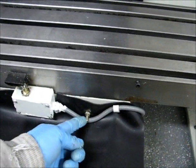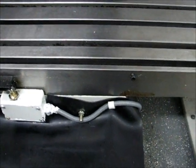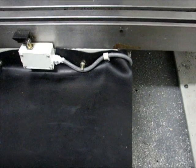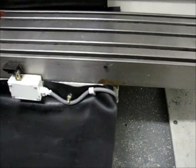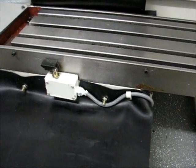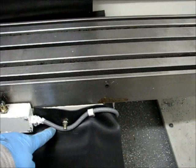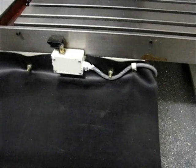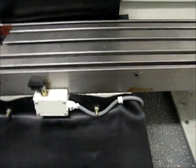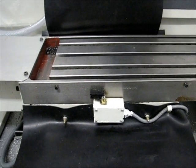I'm done with the Y-axis front. I'm not completely pleased with the routing of this — I have a shorter bolt I could put in there, maybe I'll do that when I'm adjusting the gibs next time. I ran the screw through the neoprene there to hold everything in place; there should be no relative motion between the cable routing and the thread, so it shouldn't be an issue — but that doesn't mean it won't be. I don't have the stainless steel guard in place yet, mostly just for demonstration purposes.